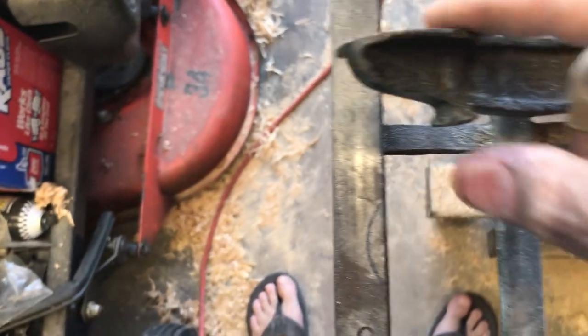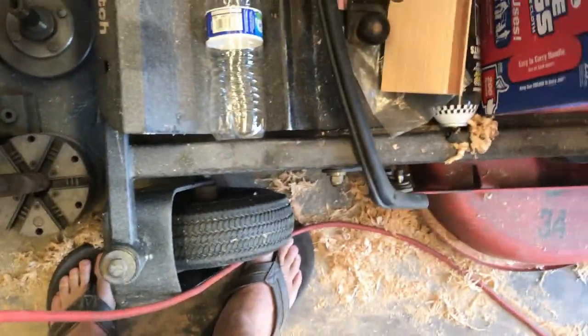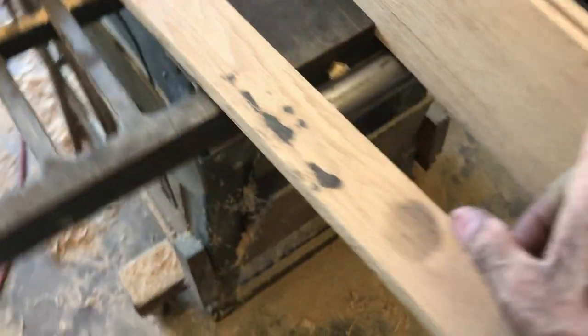I was a little disappointed when I bought these Bessey clamps on Amazon — the flat part wasn't perpendicular to the bar, so the clamp would go crooked. Luckily there was a little rise in the casting and I was able to machine it flat — you can see where I machined it years ago. I've got three of those; had four. I need to double-check they go wide enough, and I've got a couple more clamps down here — yeah, those guys. I should be good.